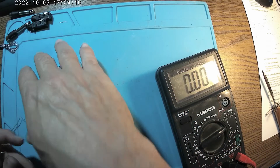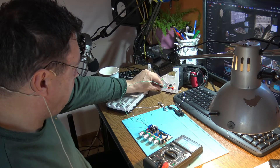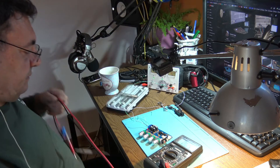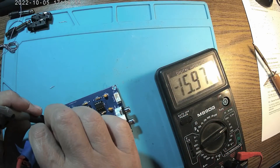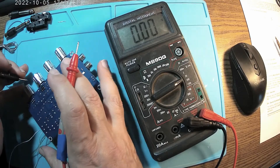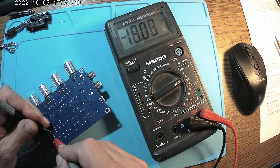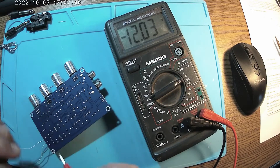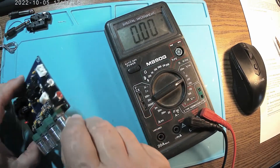It's differential already, but I'll pass this through the rectifier bridge anyway. This power supply of mine is delivering 18 volts maximum — let's go to 15. Let's check the input: 15 volts, perfect. Let's check the voltages after the voltage regulator — that's a fixed voltage regulator by the way. We should have... here, 12.03. We got power. That means the circuit is ready to run.